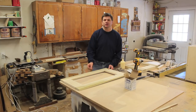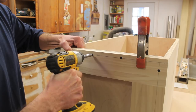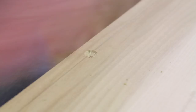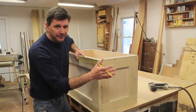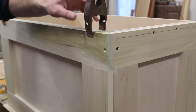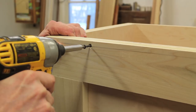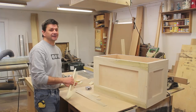Now that I've got all of my face frames put together, the next step is to pre-drill and countersink a few holes so I can attach the face frames to the box. I've attached the face frame to the sides of the cabinet and now I'm ready to attach the front face frame using a little wood glue and inch-and-a-quarter screws. I'll hold the face frame in place with a few squeeze clamps and two or three nails to keep it from moving when I attach it permanently with the screws. Once finished, I gave the whole cabinet a good sanding to make sure all joints were nice and flush, because the next step is to make and attach the legs.